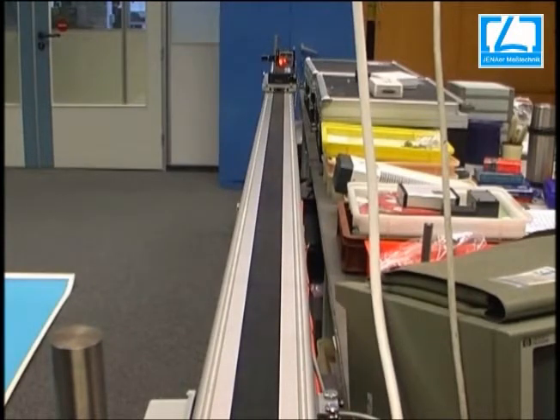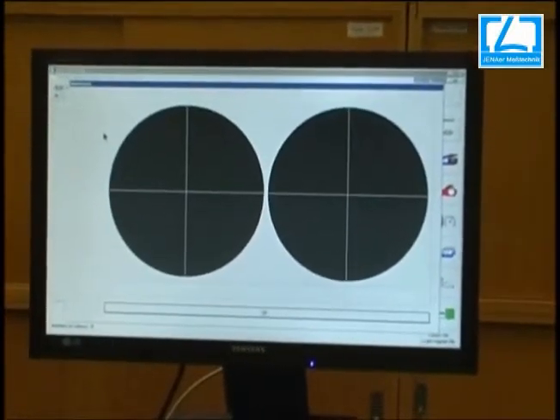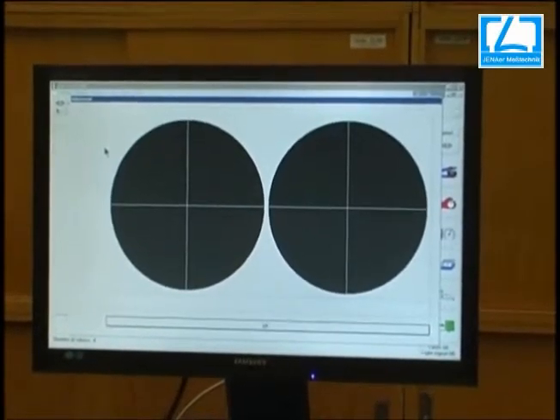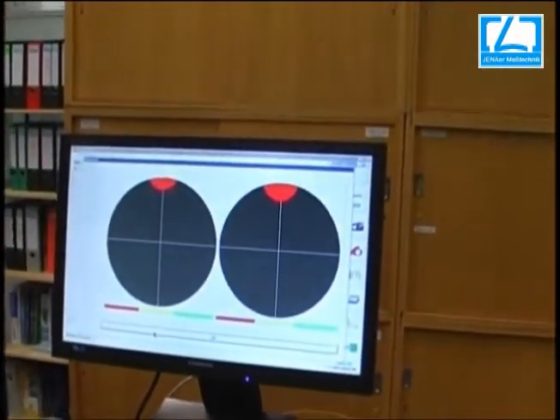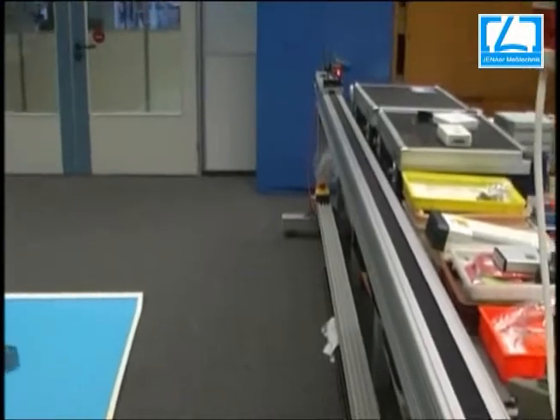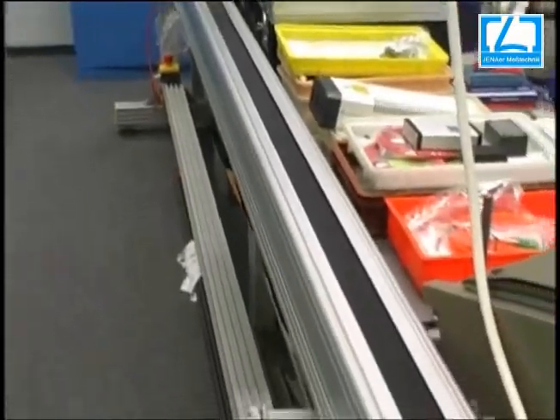The carrier is started. You move along 4 to 4.5 meters and bring the laser beam into parallelism with the movement axis and the reflector. The two crosses shown are helpful — we bring two red balls into the center line. You can see the two red balls; of course it is not well adjusted yet. We are using the screws from the stage of the laser itself. Here is the reflector at the far end.